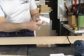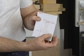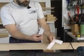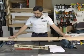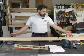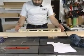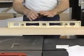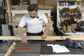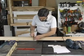This is the angle that we need, and this is the guide that fits there — we cut it out with an X-Acto knife, and this is what we'll use to set up our planer. We have our spar set in some clamps. If this were a very long spar, we'd have a long table or workbench with multiple clamps. You want the spar to be level, so we have a spirit level and we make sure the spar is level across our work surface. We planed this four-sided square, so you can also take your machinist square to double-check.